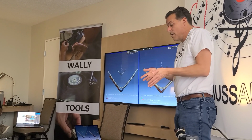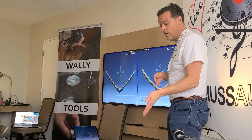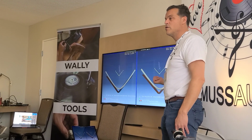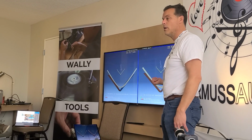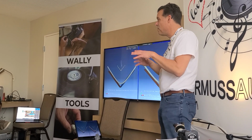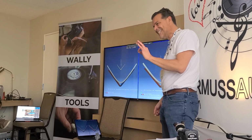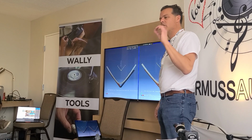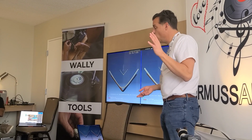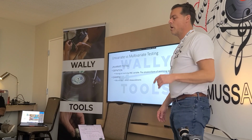It shouldn't be. The groove content has, in that case, no horizontal component, and in the horizontal modulated groove, there's no vertical component, but yet we're getting this excursion. Now this excursion, people who live with conical and elliptical styli live with this every day of their life. And you can still get great sound. And I'm not implying that you can't get great sound from conical elliptical. You can. But what's mechanically guaranteed is you will not extract every bit of information from the groove. That's for sure. Doesn't mean it can't sound great, but you won't get everything that's there. That much is clear. All right, so any questions so far?